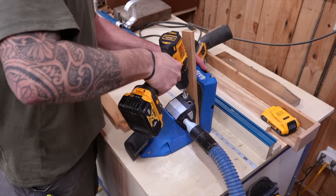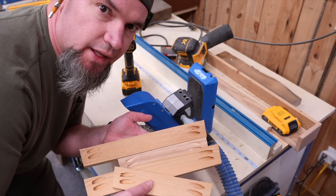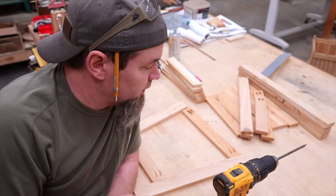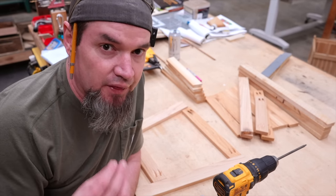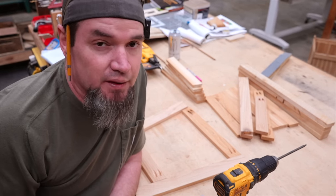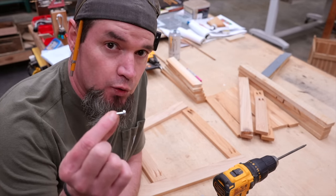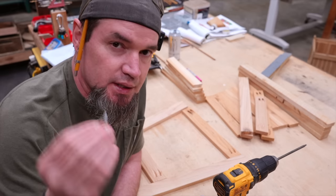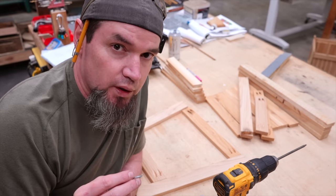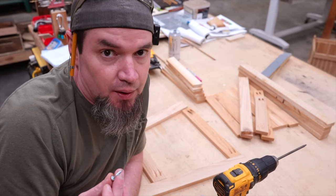If you've made it this far, don't forget to hit that subscribe button and notification bell. In our previous builds, I got a lot of comments from people having issues with splitting and tear out. The reason is that over the last year fence pickets have gotten thinner — they're supposed to be five eighths of an inch thick but you can rarely find them at that. So from now on we'll account for fence pickets being about a half inch thick. I'm changing the screw: I'll use a one inch panhead screw made for half inch material. Instead of coarse thread I'm going to use fine thread, and since we're using wood glue we can decrease the thread's diameter with fine thread. They're pretty much the same price.